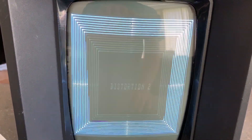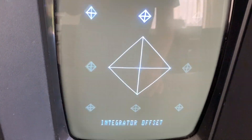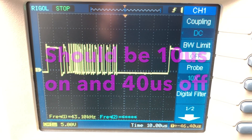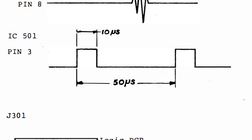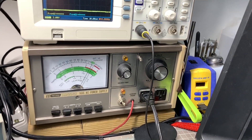The more vectors on the screen, the more stable it is. But if I switch to something with fewer vectors, like this one, you can hear the high voltage. When you put it on the DAC offset test, it's a really good test because the screen turns completely off, and this problem shows up when there's very little vectors on the screen.